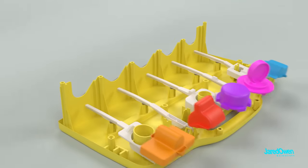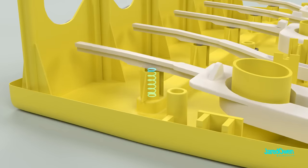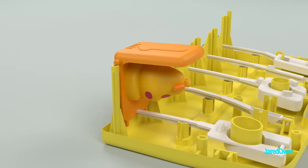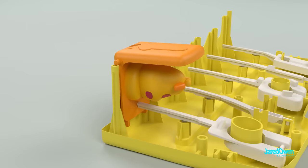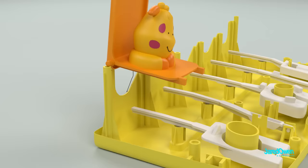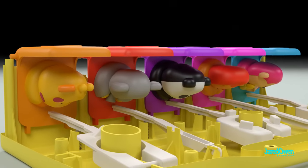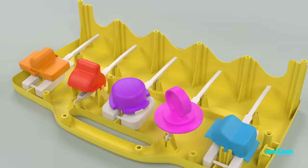So what keeps them from opening? That's the job of the five levers on the bottom. Each of the levers has a compression spring underneath it. You can see what happens when a door closes — the lever is pushed down until the door goes past it. Then the compression spring pushes up the lever and the door is locked into place. Now the door can't open. But if the lever is pushed down again, the torsion spring in the door will cause it to go back to the open position. All of the levers are identical at the very end — they hold the door closed in the same way — but the other end of the levers are all different, made so that five different mechanisms can push them down.